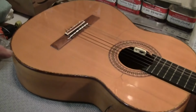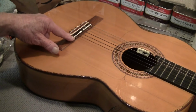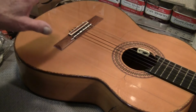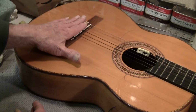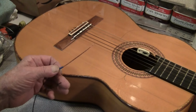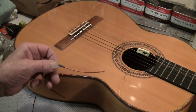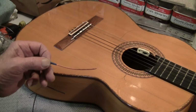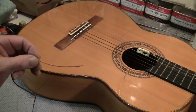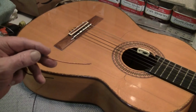So, a couple of other things. This thing is flat. Starts as coaxial cable. But you can see that this conductor looks flat. Like it's been smashed to get it down. Twenty or 30 years ago, they came up with Kynar PVDF, polyvinylidene fluoride. And it's a Teflon derivative capable of being molded and applied where Teflon can't. It's tougher. I've designed cable assemblies using Kynar insulators. It turns out to be piezoelectric.